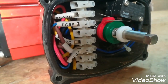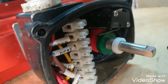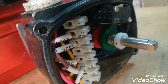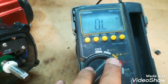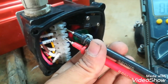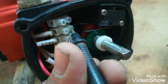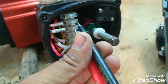We can use these switches to show the limits — open or closed — on the PLC. Here you can see when the position of the butterfly valve changes, the limit cam changes and it operates the limit switch. The green cam is operated and then the red. So with the change in position, this limit switch works. I will show you with the multimeter — we can check the limit switches. As you can see, it is zero resistance, which means the limit switch contact is closed and the red cam has operated.